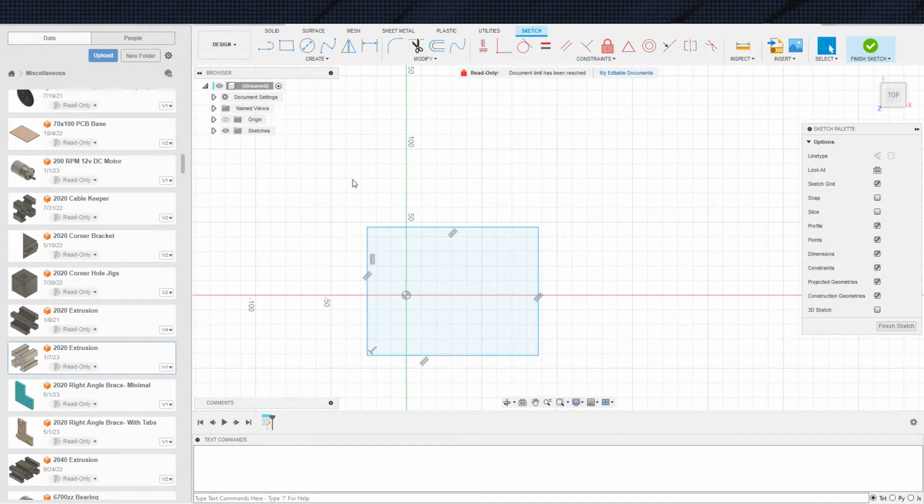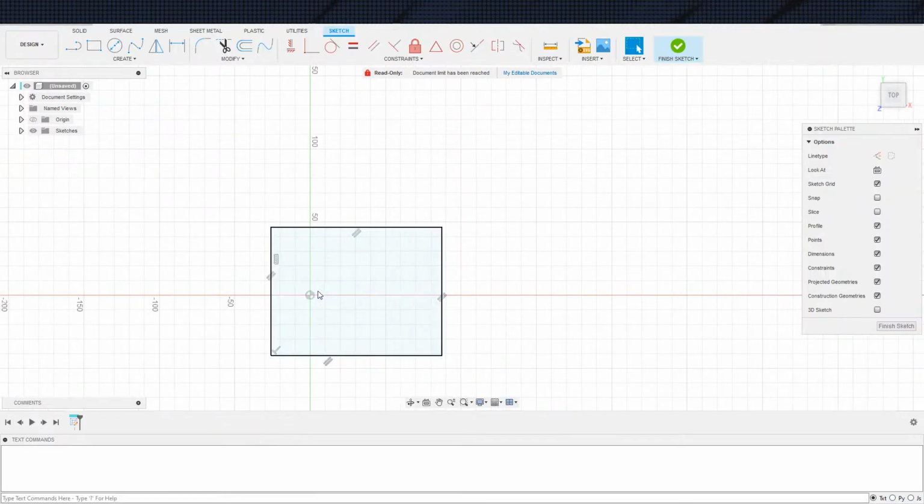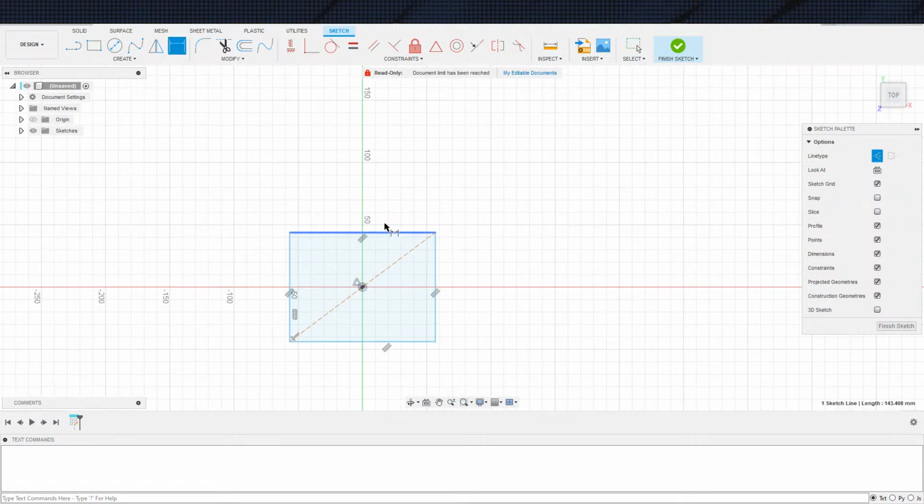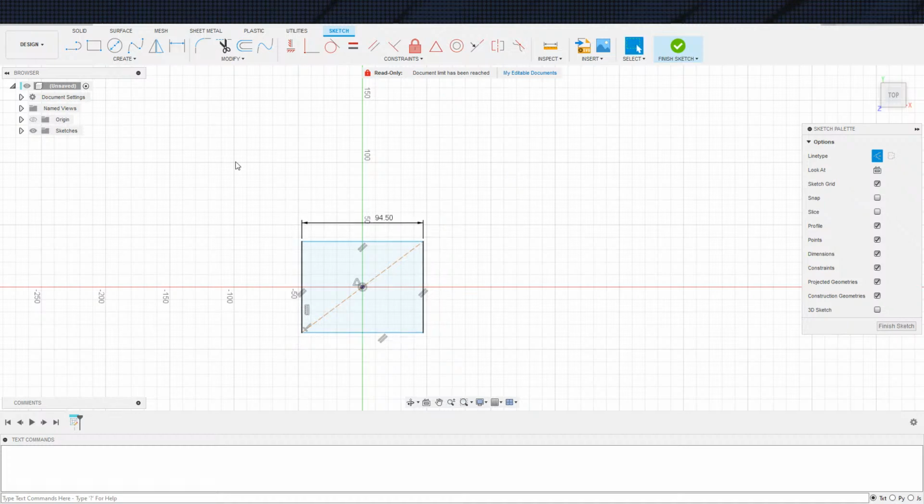Alright, so as for how the tiles go together, that is the only real question left up in the air right now. Get you centered. We are going to need this to be at least 88.29 plus a little bit. So let's say 3 and 3. So the case cover will be 3 thickness coming down into it, and then 3 millimeters of extra space on the edges, just so that the connection point is completely enclosed. That's 6 and 88 is in theory 94. I'm going to call it 94.5 because we do have a fraction decimal that we're taking care of. And I will round.